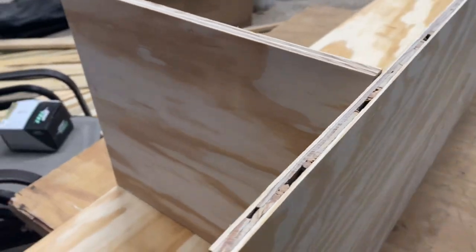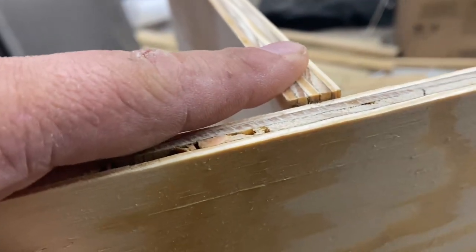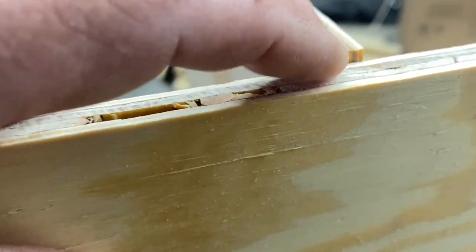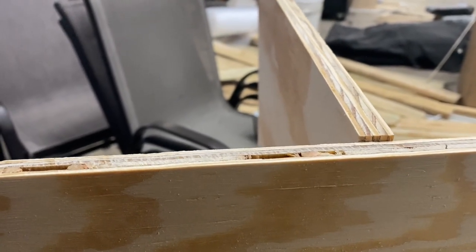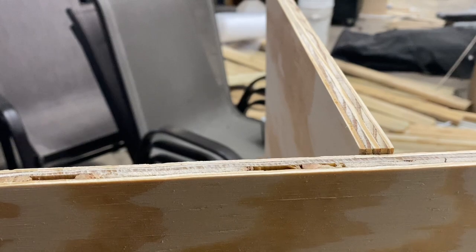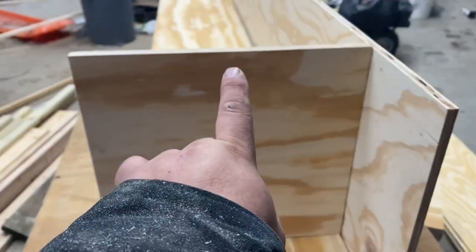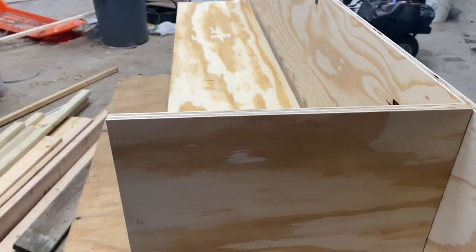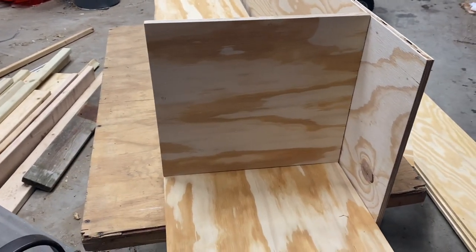I always try to make sure everything lines up perfectly, so you get it at the right height. As you can see, I'm just a hair higher on this side, so the backing will be just a hair short — which is okay. You won't see it once it's all put together. We had 16 inches across, and we got 14 and 7/8 to get there, and then we'll be 8 foot wide. We'll have four boxes in each one. I'll show you again more when I put it together.